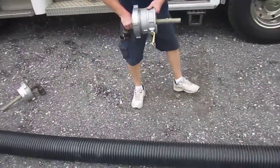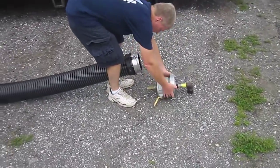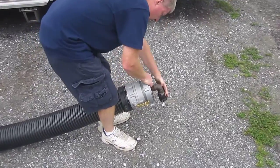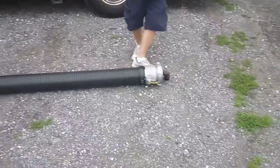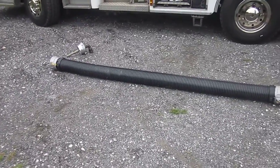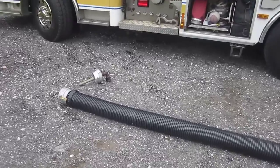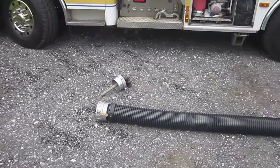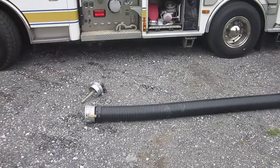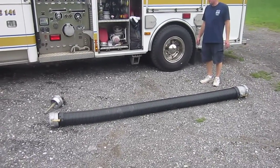It doesn't matter what I tell you as a driver — when you get ready to run these jet siphons, you have to look and see what resources you've got left in your driver's compartment. We carry plenty of these adapters to be able to flow two jet siphons and draft at the same time. That's going to be the case on both rigs, so there shouldn't be a need to say you're missing an adapter. It's your choice. I'm not sure there's a preference — it really is going to be based upon how you're set up to draft initially and what devices you are using. You can go either with the male end or the female end. Just take a moment to think about what equipment you're using as to which one you go with.